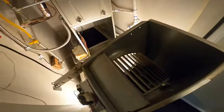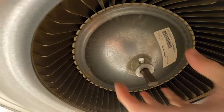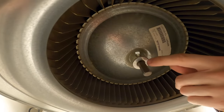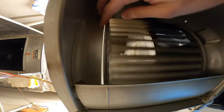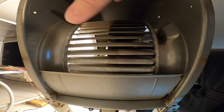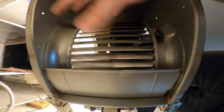The first step in disassembling this is to remove the screw which is right there. That's going to free the blower itself and then I can remove the motor. When you do that you need to be careful — it needs to be in the right place when you put it back in, because if you don't, the blower will no longer be centered in the assembly and it will touch on either this side or the other side. Also when you disassemble this, it's a good opportunity to clean the blades of the blower motor assembly if they are dirty.